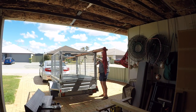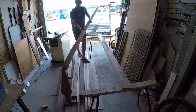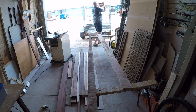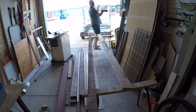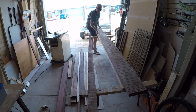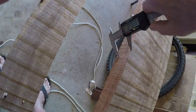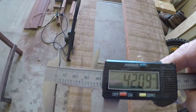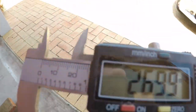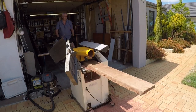A bit of unloading — the old red flag to let people know there's a bit hanging out the back. This is the skinny bit he cut off the side; I'm going to use that for some brackets later. I put down a laminated beam underneath the long strip to try and save it from bowing while working on it. First problem to overcome: it's thicker at one end than the other, so the first of many passes through the planer coming up.